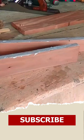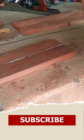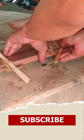I apply glue on both surfaces and rub the pieces to spread the glue evenly. I already tied some jute ropes which are slightly bigger than the required width and slide it in. Then I inserted a small wooden piece and rotated them until the glue started to squeeze out. I wipe off the excess glue — as you can see, some more glue is squeezing out on applying pressure.